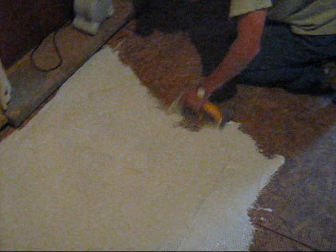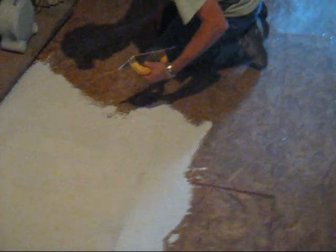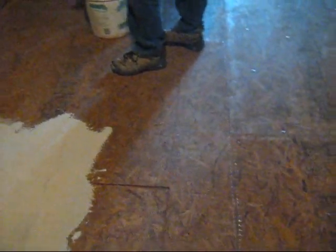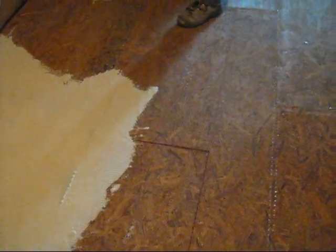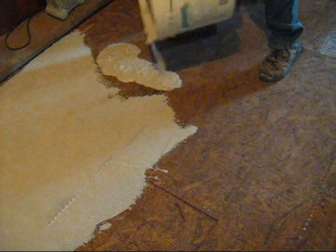He's got five thousand square feet of this to put down very soon. We discussed whether to use mesh or go right on the concrete. On concrete you don't use mesh — you use a membrane like a Schluter-Ditra, which is a waffle-type product that adheres to concrete. It's actually the best product on the market for that.